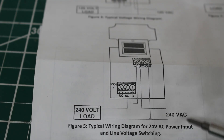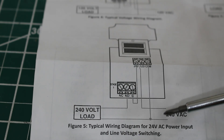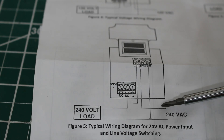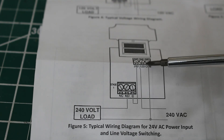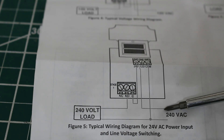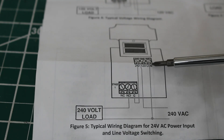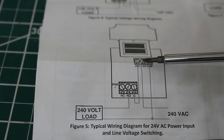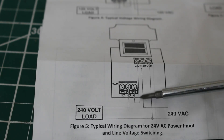Here's our next wiring diagram. In this case we're going to be using 208 or 240 volts for supply and load. It is essentially the same thing except for the power supply terminals you use. For 240 or 208 volts, we have two lines of 120 volts — measuring across them gives you 208 or 240, but each leg to ground gives you 120. So instead of using the 120 terminal, we use the 240 terminal and common. We follow the same process with our common and normally open contacts, also jumping power over to common.